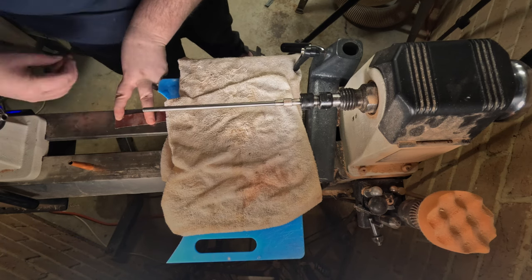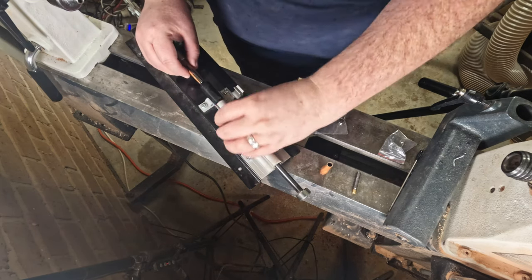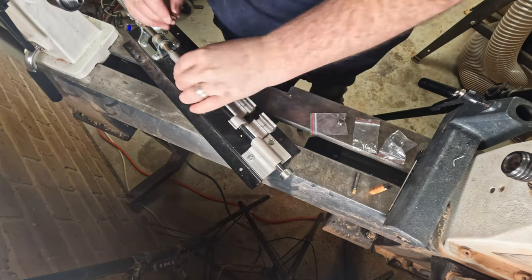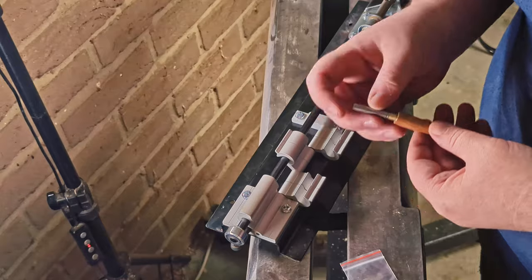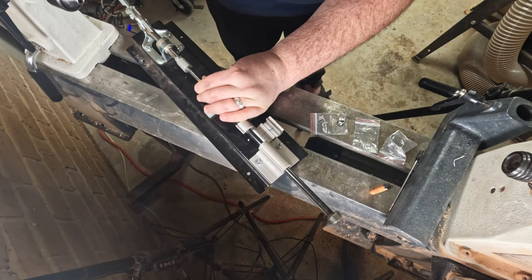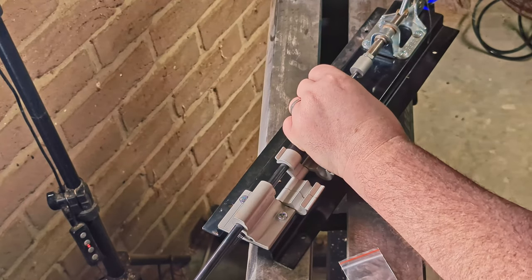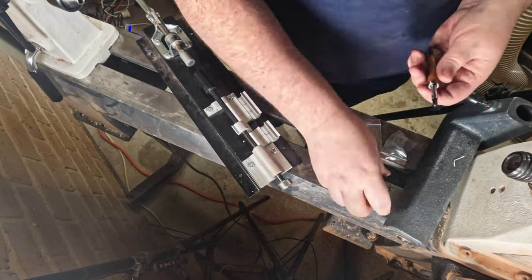Some release easier than others. Moving into assembly and then we've got some photos. I'm pressing the clip and top of the pen on — that's only got one piece that actually presses in. The bottom bit has the nib as well as the mechanism for the pen, so I start with the nib. I put that in the hole in the black portion of the pen press, because then I've got the nice broad flat bit for the back. I'm going to do the same again with the mechanism. You'll notice I stop and I put the pen insert in and I check what it is doing — not quite far enough. Having done these a few times, I now know I've got to go a little bit further, and second time's a charm. It's better off to stop early and double check before you ruin things.